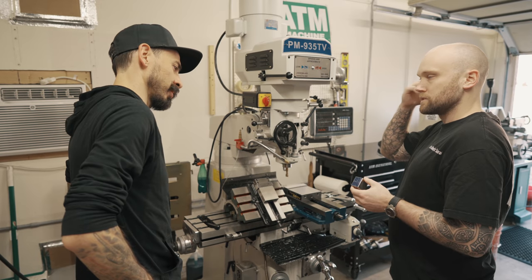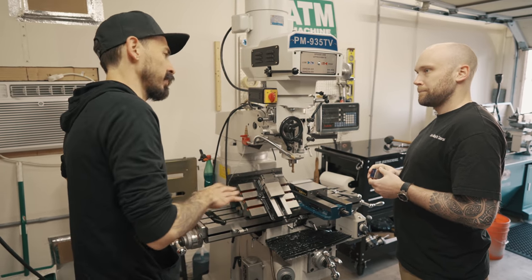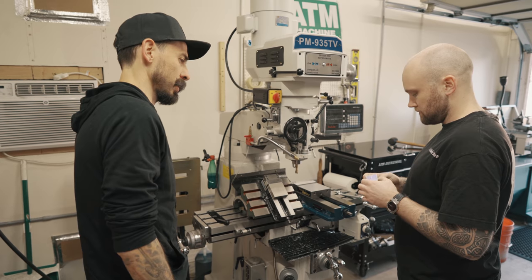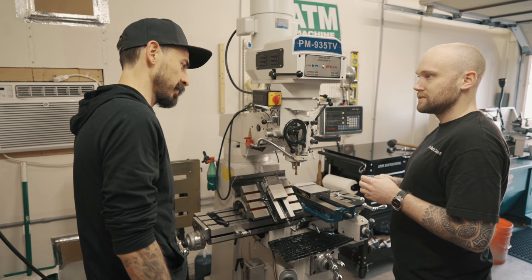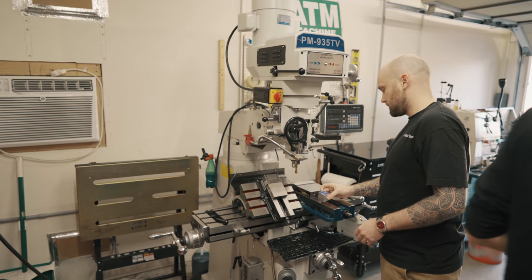And then just any specific finish you want? No. Like, what's the rest of the aluminum? It's like a straight grain, kind of a rough, sanded finish. It's not polished at all. Okay. So, yeah, I'll just straight grain it with like 220 or something like that. Yeah, that's perfect. That's really all there is to it. Right on. Let's get some footage of this. I'm going to do some IG stuff too.